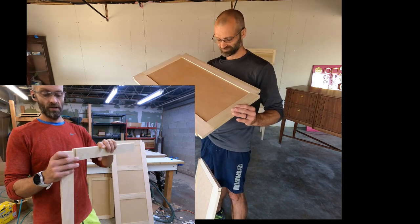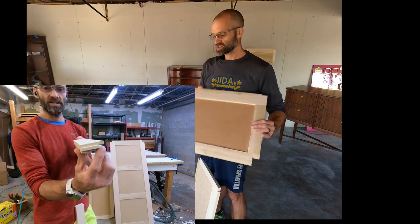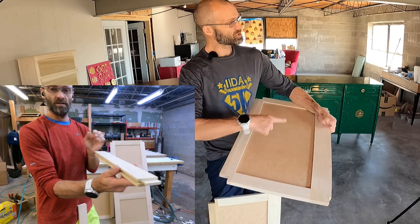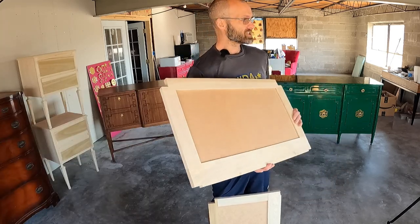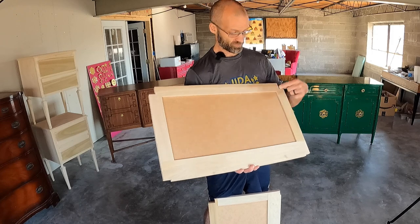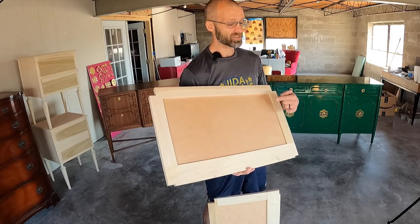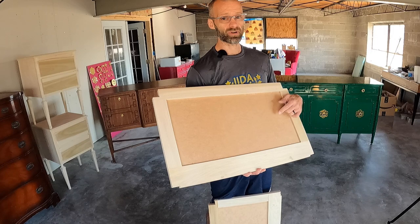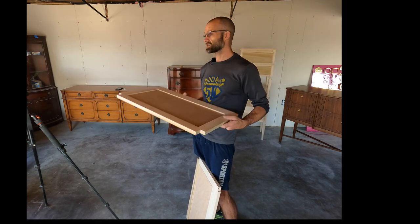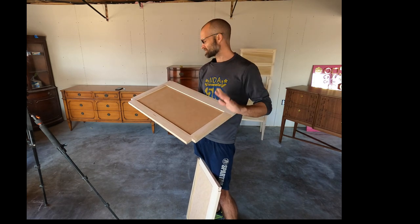The raw stock to make this framing panel is basically two inch. In areas where you need added strength, you'd obviously make it thicker — we've got three inch here on the front, two inch on the back, two inch on the sides. The other component is the center panel, which in this case is MDF. MDF is not a material I generally support in most furniture making. However, in the framing panel I think it's completely appropriate. In super high-end pieces I'd recommend Baltic birch, but for most furniture MDF is fine. It lasts a long time as long as it doesn't get wet, and because I generally paint furniture, it also gets primed, so I don't worry about it.